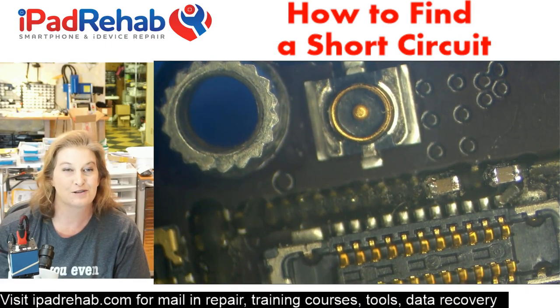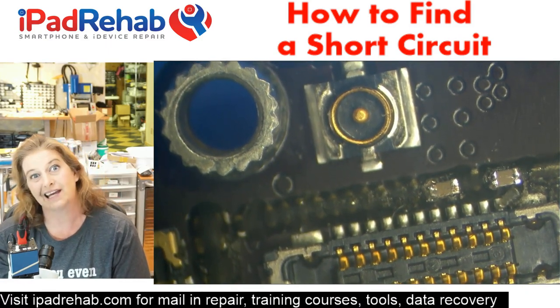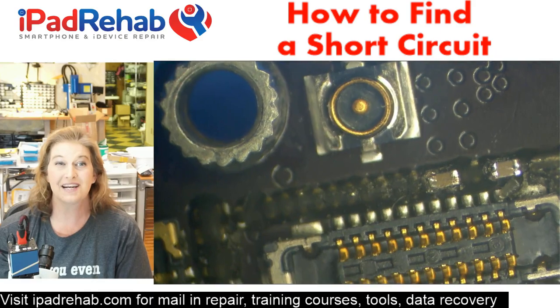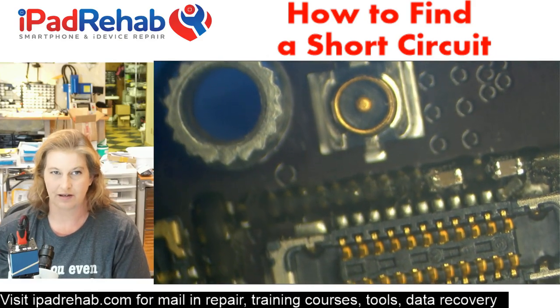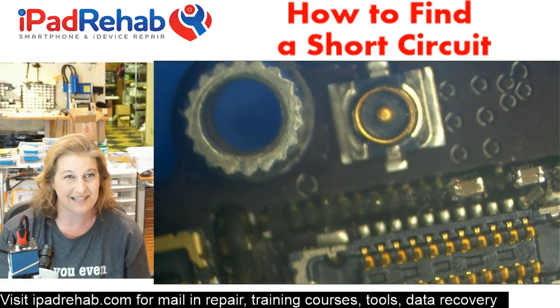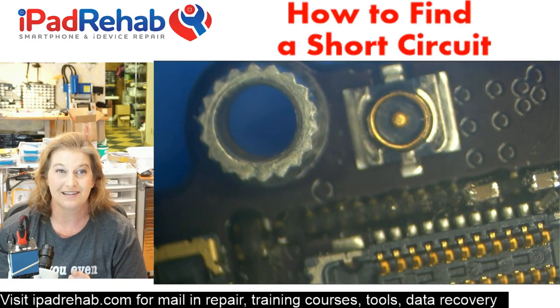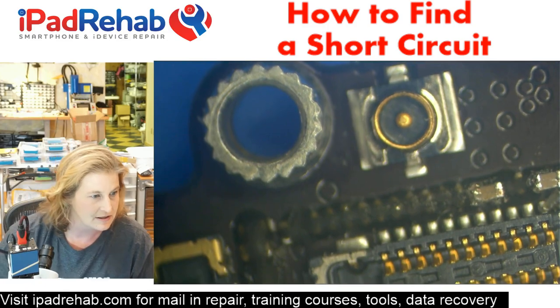It may be that somebody was probing around here and made that short because they were troubleshooting some other problem. But right now, as it stands, this cap is our number one candidate for why we have a short. Even though the heat was at the PMIC, this cap is on the shorted line that we found with a multimeter, and he's the ugliest looking dude.